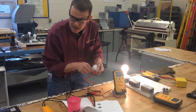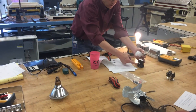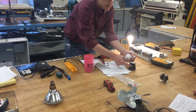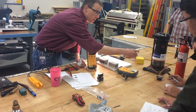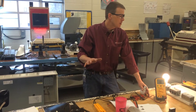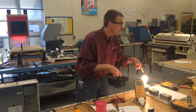Go ahead and measure the resistance in the heat kit, the bigger white light bulb (the floodlight), the fan motor, and the contactor. For the contactor, measure at the coil side to side to energize the magnet and get a number, and also measure across the contacts. You've got about five minutes. Everyone uses the meter once to measure each thing — it might take a team, with one person holding the component while the other takes the reading.